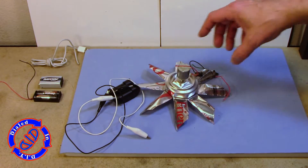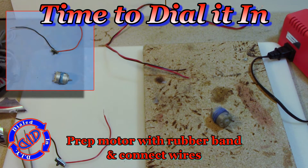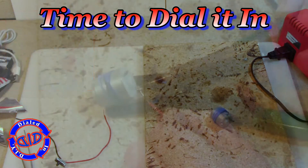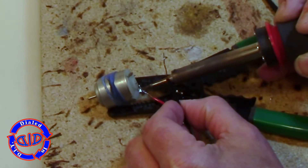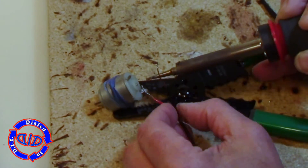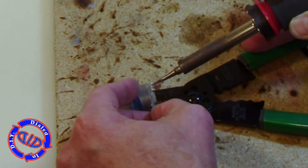For this test I just hooked everything up with alligator clips, but it's time to dial it in and make things a little more permanent. The first thing you need to do is take a rubber band and put it around the motor — you'll see why that's important in just a second — and then start the setup for the wires. I'm actually soldering the wires right onto the DC motor, but for the rest of the connections I'll try some different approaches to give you options.